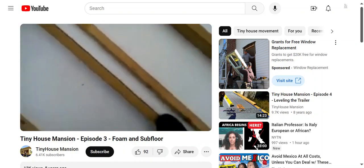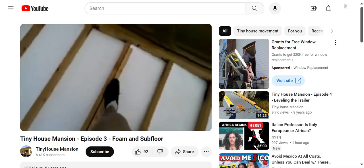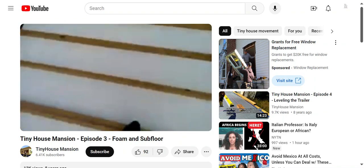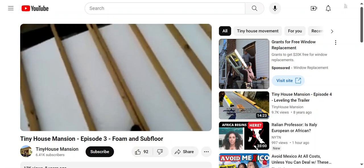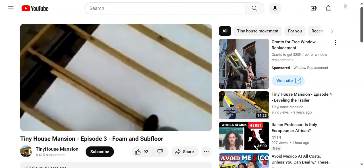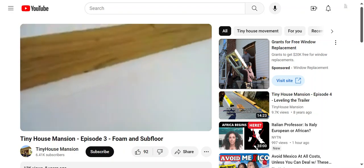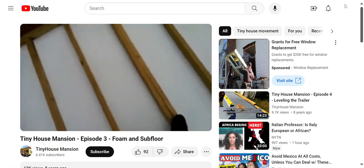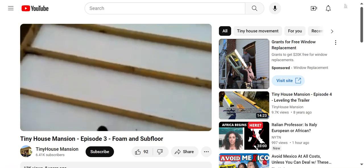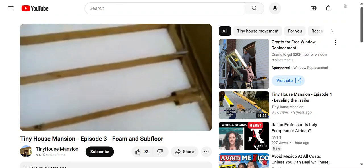One corner goes in first and then step on the opposite side. I cut these a little bit wider than 14 and a half inches so they'd stick a little bit better and close off the gap. You can see there's no gap in between - just a little bit more air tightness. Just don't cut it too much wider or else you're not going to be able to fit your panels down in there.